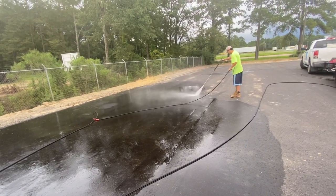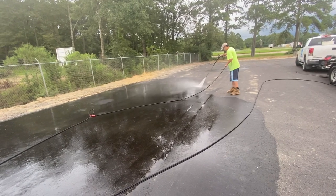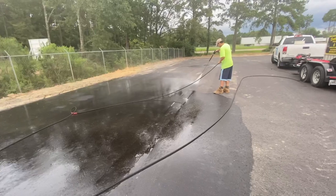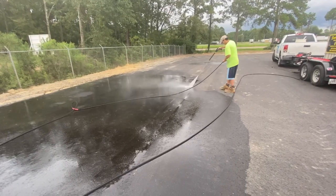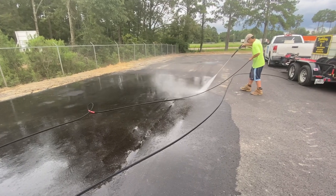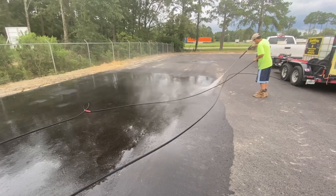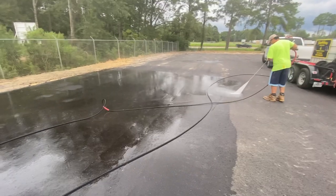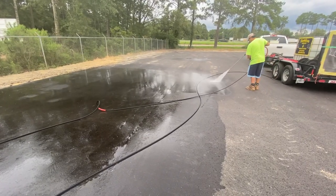Basically what we do is come in, as you can see right here, and do a little washing from a distance — just enough to dislodge some of that dirt ground into the blacktop. Don't expect to clean this in one pass. This is not normal concrete, so you can't put a lot of pressure on it. The first pass you can probably get about half off, maybe even sixty percent. The second pass you'll get a little more.